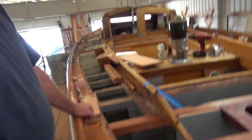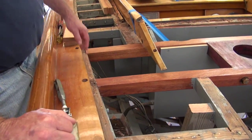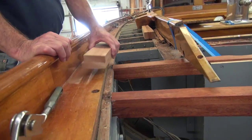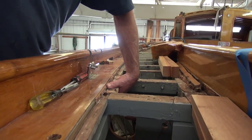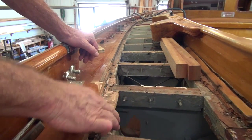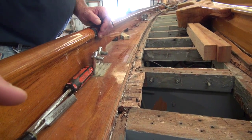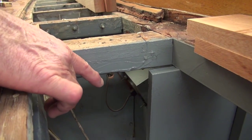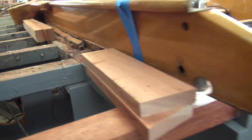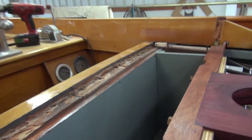We're not coming back here right now — pretty much done here. We've got this rabbet pretty much cleaned up all the way up to here. We're going to change these out — this was like a repair that was done, there was some rot in the deck here. We're going to change these out to get a little better compression. As we go, we Smith's all the bare plywood that the box used to be — Smith's penetrating epoxy and then a single coat of bilge gray. So they were just bare plywood with nothing protecting it.